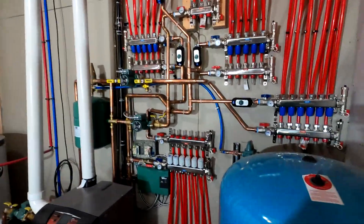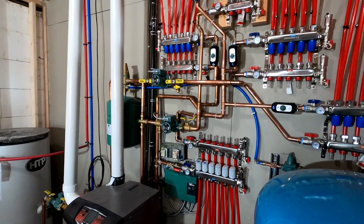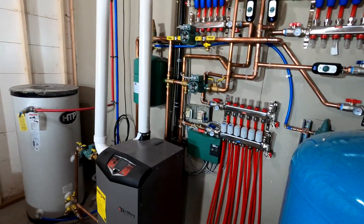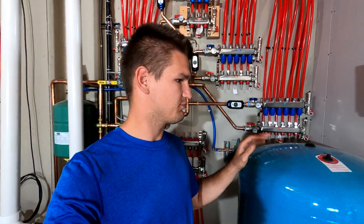Instead of making this a super long video, I decided to break it up into two parts, so this is the end of part one. Let me show you where we're at: everything is hooked up and connected. I've got the boiler intake and the flue all plumbed in. Now we're just waiting for my water sample to get tested so I can find out what kind of water softener and iron filter I need — I don't want to trash my boiler with dirty water. In part two, we'll get the water softener and iron filter in, charge the whole system, try to balance it, and I'll explain what all the different components are and their functions. If that's something you're interested in, stick around and I'll have part two out as soon as I can. Thanks for watching. Take care.